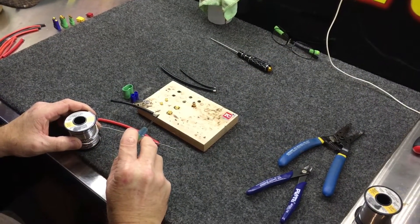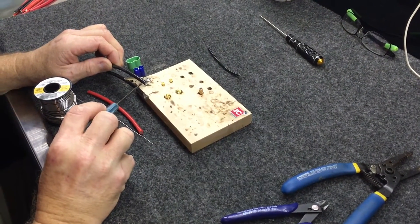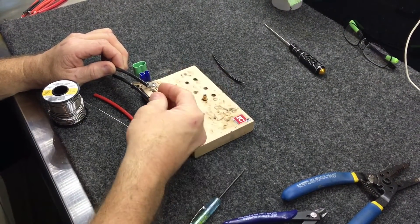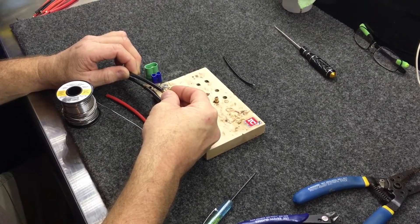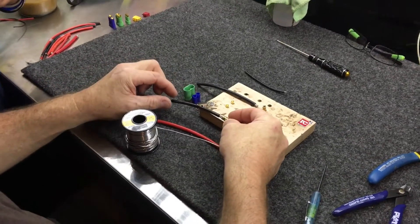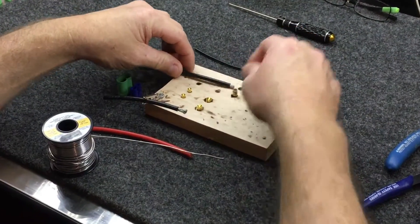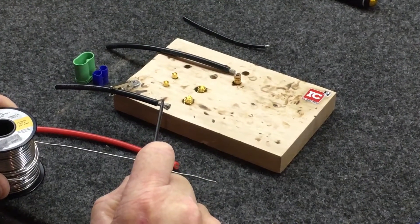Now we're going to talk about stripping the wire and tinning it. We have different size and diameter wires — red and black, everybody knows that. We take the cups, check the end for depth, and it's better to verify these ahead of time. If the first one fits well and the second one is a little bit long, we don't like it being long because then you have bare wire showing from outside the connector.